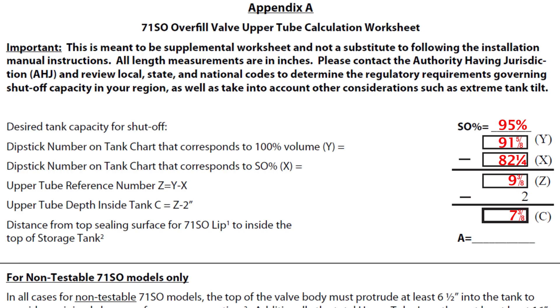This must be at a minimum of 6½ inches to allow workable clearance for the float arm in the tank. If our calculated value is greater than this, then use the calculated value. If it is less, use 6½ inches. Since our value today is 7⅜ inches, we will use that instead of the 6½ inches.